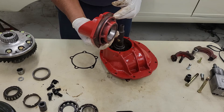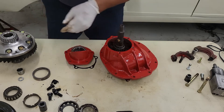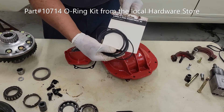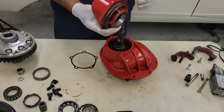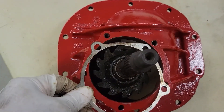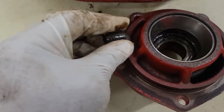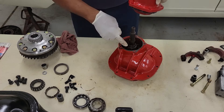I had ordered the O-ring and every time I received it, there's only one and it's actually too large. So what I did was I went down to Lowe's Hardware and bought this pack of O-rings — here's the part number, 107-14 — and I bought this for about $1.10. I picked out the best O-ring that I could to replace the old O-ring with, and it was the only one that would actually fit. Next, we're going to put our shim in place, and then I'm going to take a little grease and put it around the O-ring. We don't want to damage the O-ring when we slide it back onto the housing.